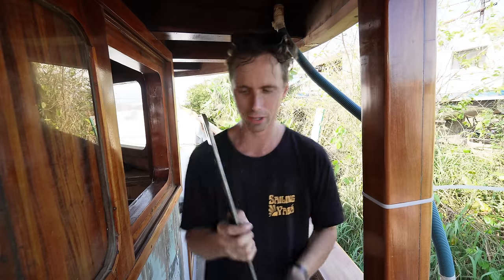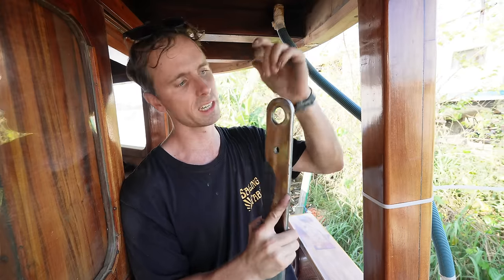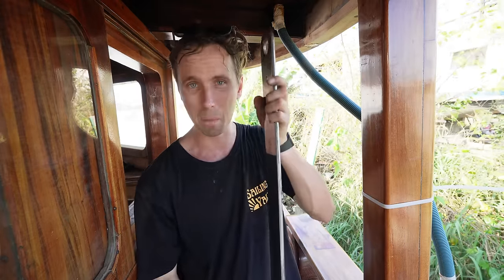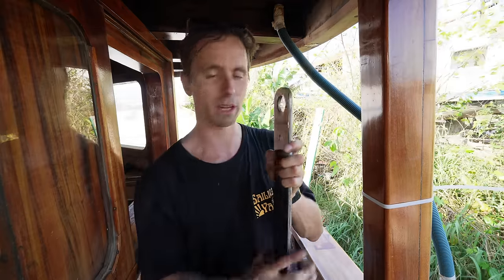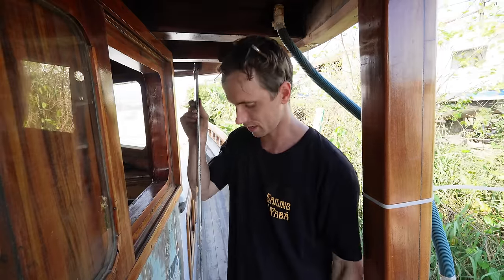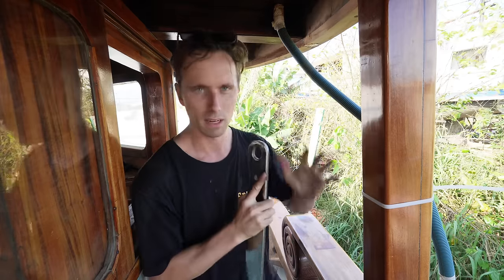In order to do so, I brought the chain plate next door and they have made them completely straight. The reason for that is because we want this little ring where the stainless wire tensioner is fastened onto just to stick above the bulwark and the rest under. So we are going to make all the incisions and cuts needed and put this facing downwards, and then make the last little bend later on wherever the lowest bit has to be fastened against the hull.